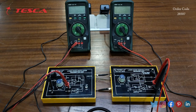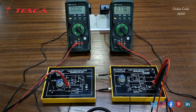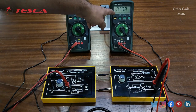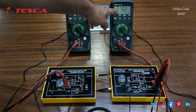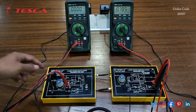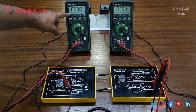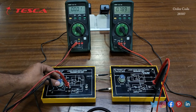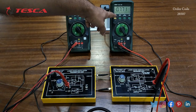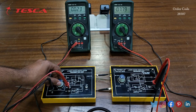Now we will switch on the adapter supply and the multimeters. At the transmitter unit the voltage is 0, and at the receiver unit the voltage is minus 0.792 volt across PO1 and PO2. Now we will slowly increase the transmitter unit voltage using the SET PO port. Rotating it clockwise causes variations in the PO1 and PO2 output voltage.